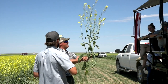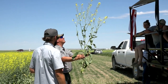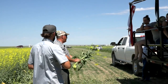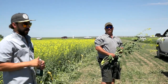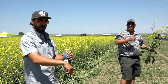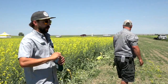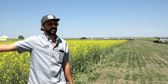When we're trying to set up our treatments, we want to make sure at the high end we hit the injury level. The first year we just really didn't see it, so we had to add another rate. The 10-34-0 liquid was put down in both our air seeder and the Monosem right down with the seed row — in the air seeder it goes right in a drop tube behind the seed before the furrow closes, and in the Monosem it's basically the same thing. One of the challenges with the Monosem was we had somebody out here just spinning a wheel every time we wanted to go down into a plot to get the whole system primed.